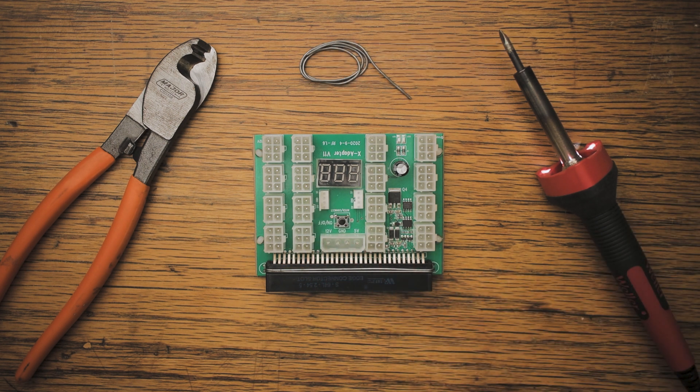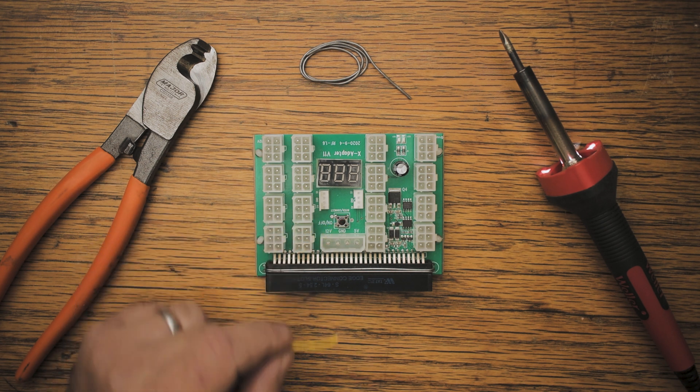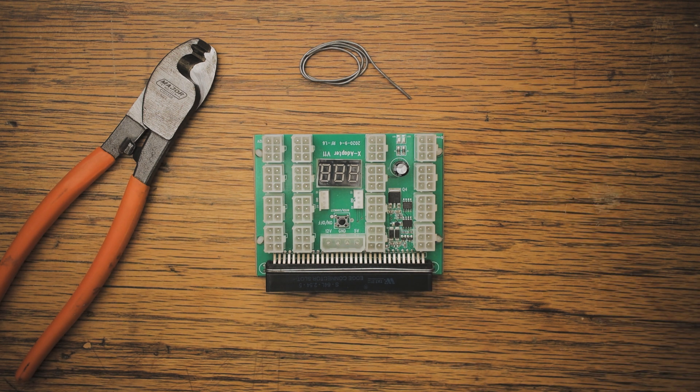A little piece like this will do. The first thing we want to do is locate pin number one and pin number four — that is where we will solder in the piece of bridge wire, and that will enable the circuit to turn on the breakout board and the power supply continuously. So we take our soldering iron and the soldering wire.